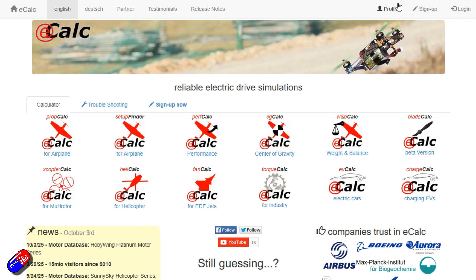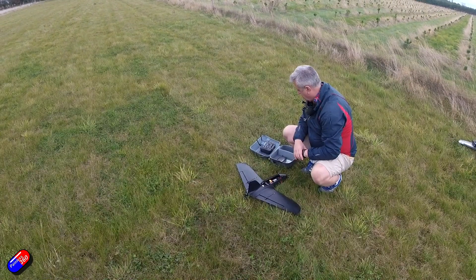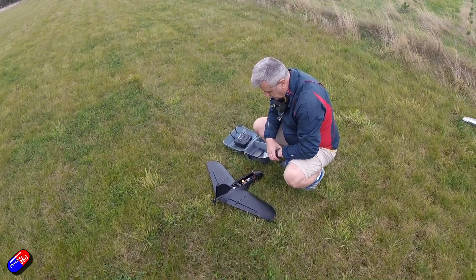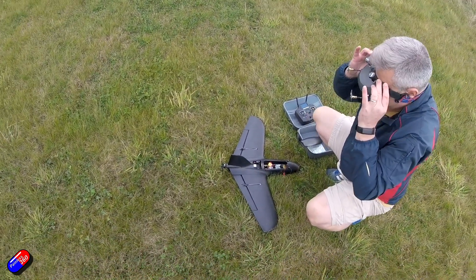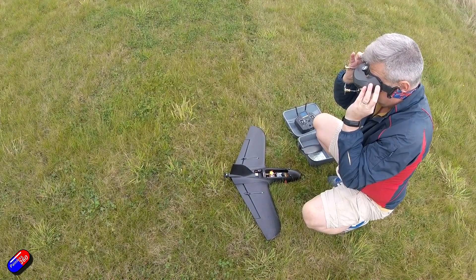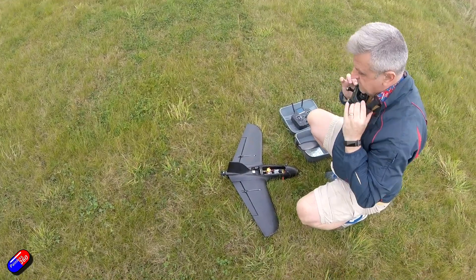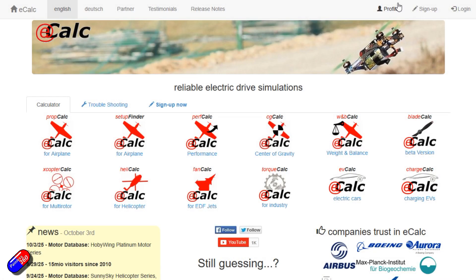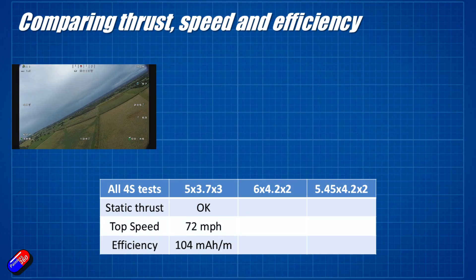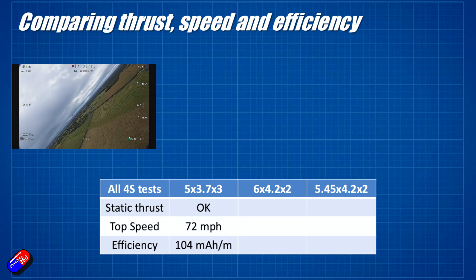For those of you that have been watching my channel for a little bit, you know that I've been playing with my TBS Chepito, trying to find an equivalent two-bladed prop to the three-bladed one that came supplied, that's going to give me an equivalent level of performance but with less noise and hopefully slightly higher efficiency. It's one of those things that I've been doing iteratively, because most of the time the props that come on it are kind of perfect out of the box. However, with the Chepito, it has been designed really for 6S ripping around the sky and the props have been chosen for that use, and I want to use it on 4S in a slightly different style of flying.